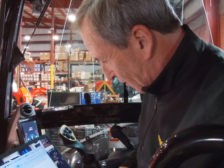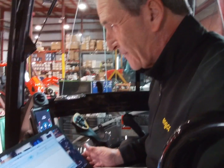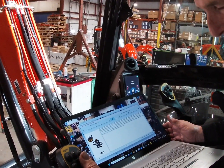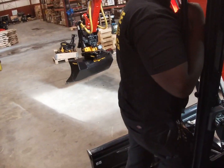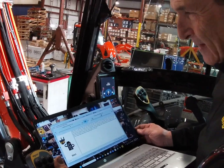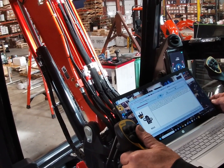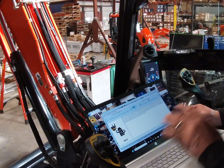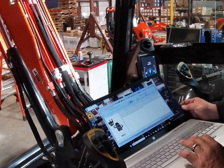Now we're going to do the maximum for the feeder valve. So bump it back straight again, and now you're ready to start your timer. Just crack the throttle and crack the thumb wheel wide open. Target right between 7 and 8 seconds. Sounds good. Yep, and it's operating nice.